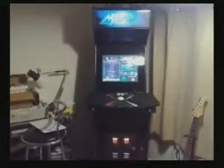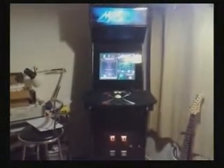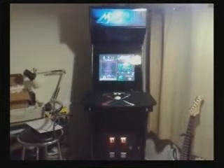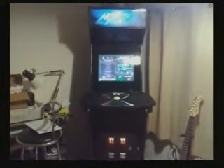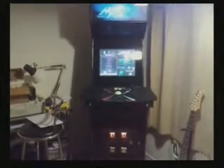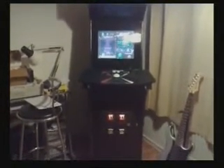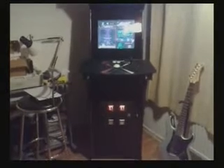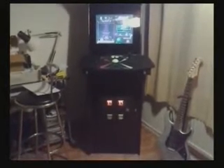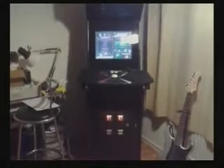Hi and welcome to my video. This video clearly demonstrates what is possible with some creativity to actually build your own arcade machine. The entire arcade cabinet in this video was home built using 18mm birch plywood. Some people generally use MDF, but because of the weight of the screen, the cabinet walls would bend out, so I chose to use birch ply.